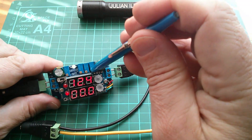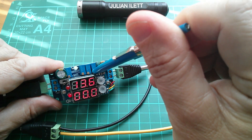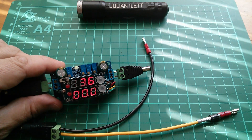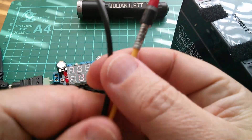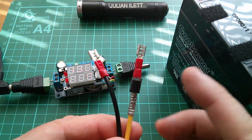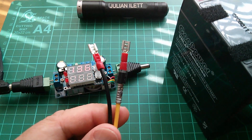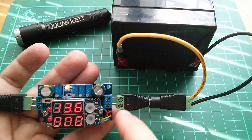I'm going to raise the output voltage up to 13.5 volts, because that's the maximum voltage I want my battery to go to — so there's 13.5. Now I could current limit it; I don't think it's really necessary with a 20 watt panel going into this lead acid battery. I've put a diode in the yellow wire from the positive because the eBay listing says you can't connect a battery directly to the output of this converter without the diode — otherwise this thing will blow up. Let's connect it up. That's it connected up — it survived, it's fine, it didn't go bang, so the diode has protected this.